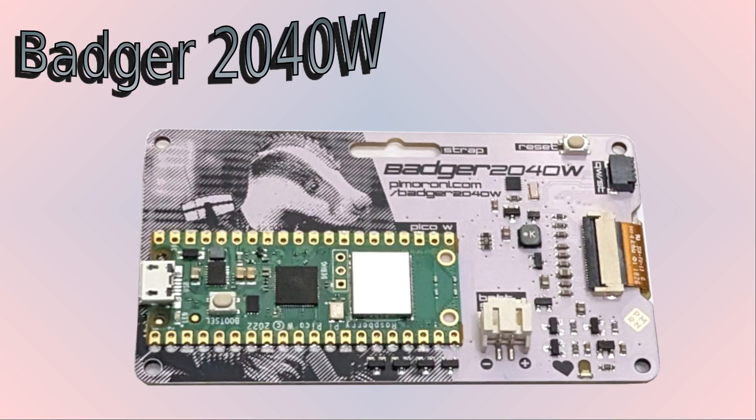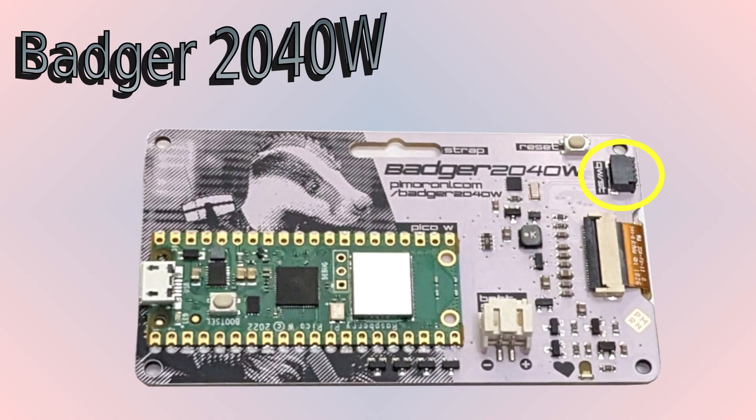I expect they've used the Pico because of the wireless functionality in the Pico W, and this may be due to the amount of testing needed if you create your own wireless baseboard — the module has already been tested as part of the Pico. Because this is just a Pico, it means it uses the micro USB on the Pico rather than the USB-C which was used on the Badger 2040. Most other features are the same, including the Qwiic or STEMMA QT connector for connecting external devices, and the additional reset button — a nice addition so you don't need to physically unplug the USB cable to restart the device.